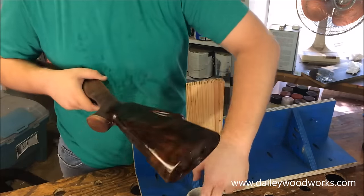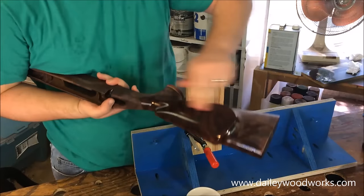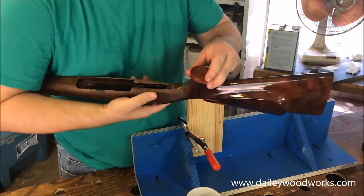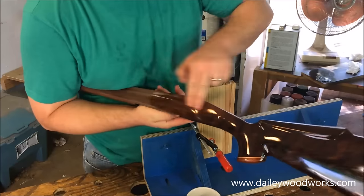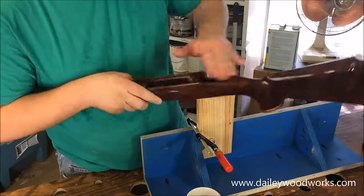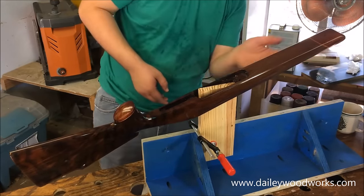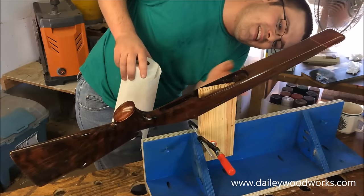After wet sanding the full strength coat I did an additional three coats on top of it. Each time between coats I would buff it out with AAA steel wool and then remove all the metal dust, then apply a coat on top. The third and final coat I left as is because it got a nice satin finish. With True Oil you want to rub it in to get full coverage but do it as thin as possible. The great thing about it is even after the finish is dry you can put a little dab to touch up a spot you missed — with your fingers it heats up, soaks in a little deeper, and kind of polishes itself in.